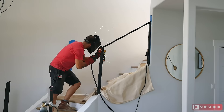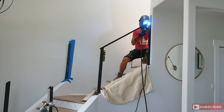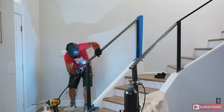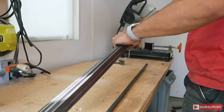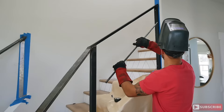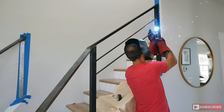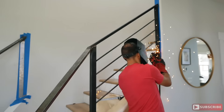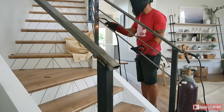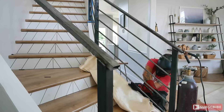The posts themselves were two-by-two, the top railing was two-by-one, and the individual horizontal slats were half-inch by half-inch material. Due to the nature of the railing angling and pivoting in different directions, it wasn't realistic to build everything in the garage and then assemble it in the house. So my best approach was to install the posts upright first, make sure they were straight, and then tack-weld each individual piece into place. I used a welding blanket below to make sure sparks didn't catch the house on fire or damage the completed work. Then we brought everything to the garage and finished with strong welding beads.